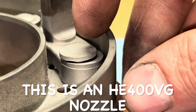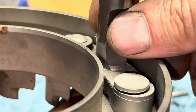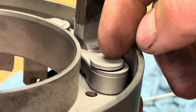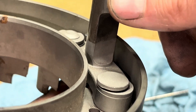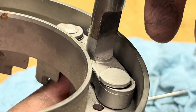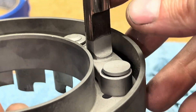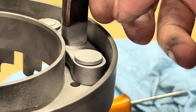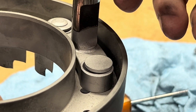Now this one has actually been worn really bad in this area, so this is what also caused a bunch of issues with it — jamming probably. You can see it's mushroomed right there. It's got too much play and that's probably going to be a major issue anyway, but it's already ruined for other reasons. That is what I would look for on the other one. The other one didn't have that issue — this one's not mushroomed, but the other one's in worse shape.